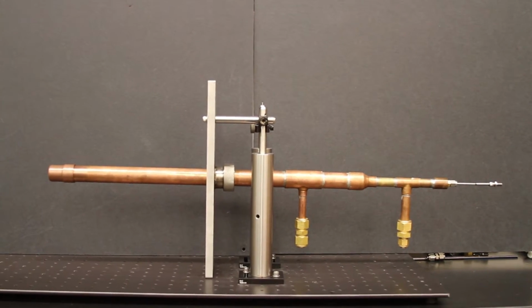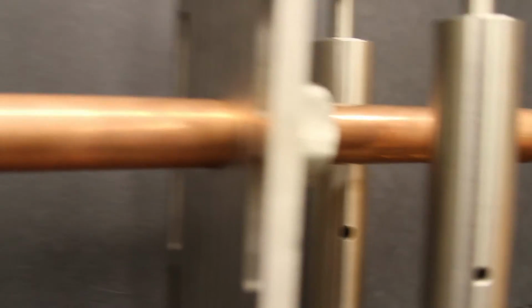At this point, we have a fully operational probe which is able to transmit light from the plasma to the outside of the chamber. The probe was also able to cool the lens enough to keep it within its operating temperature range. One specification that we were not able to satisfy was the level of collimation of the light going into the probe. We wanted this light to come in at an angle of less than 5 degrees. We were not able to satisfy this, but this isn't really a critical specification, and improvements can be made in future iterations of the product.